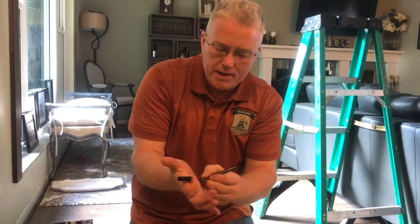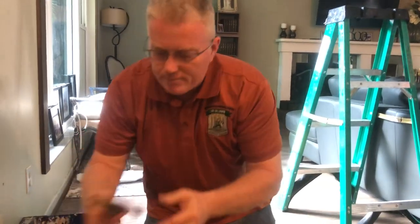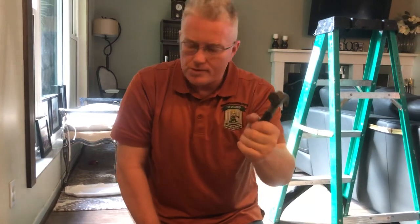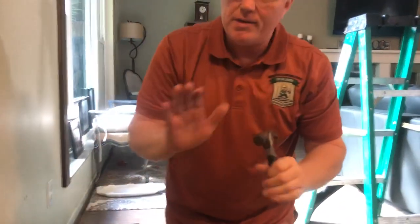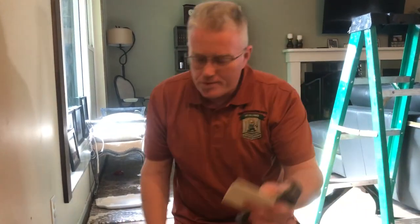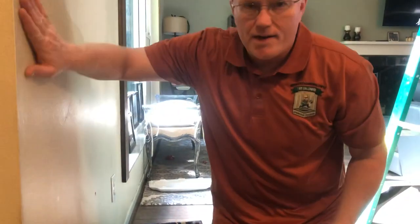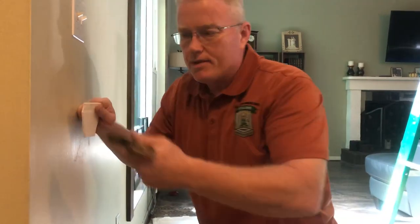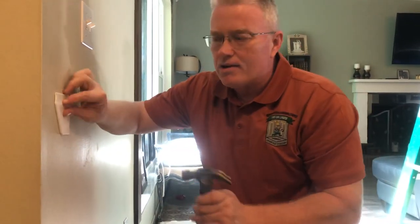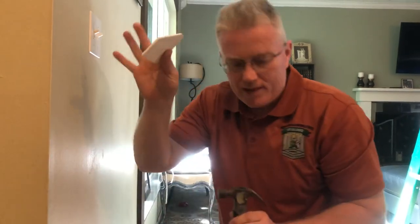I have a better hammer than this but it's a great tool for banging in little nails or screws that are sticking out — most of these jobs have either nails or screws and you just hammer them right in. If you want to go real gentle on a wall and you're in a bind, use one of your smoothers to disperse the impact — you will not dent the wall if you disperse the impact with something like this.